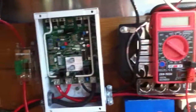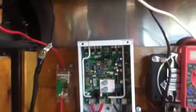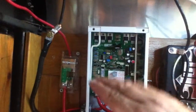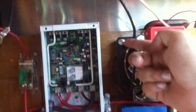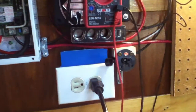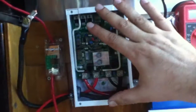You've either got to get their faceplate or have a multimeter nearby — I've velcroed one on here to be able to diagnose it. I also left enough of my 12-volt DC connecting stuff exposed so I can get the probes of my multimeter to some points without removing the faceplate. I really don't want to probe inside with a multimeter and accidentally touch something. On the panel side, I have the panel negative and positive coming in, and I can take a reading at this fuse block without popping a cover off.